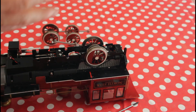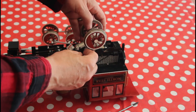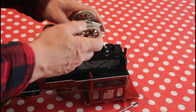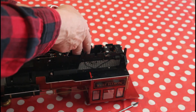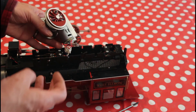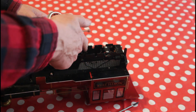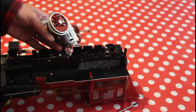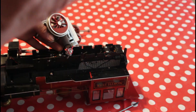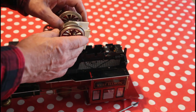Here's the finished assembly. I've had to cut away all the insides — the original gearbox mountings and motor mountings. I found part of the reason this gearbox kept failing: the plastic inside had turned into something approximating butter — it wasn't so much cutting it off as pushing it off. So the motor was able to move around a lot. The new 3D printed housing is pretty hard, so it's not going to move around.